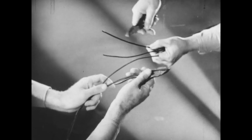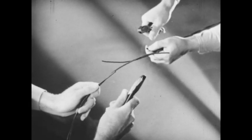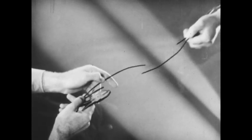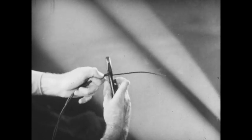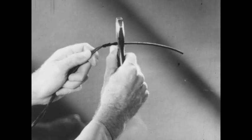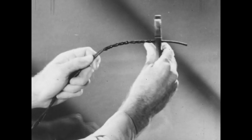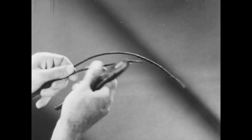For uniformity, each man measures back six inches — or the length of his pliers — on one of the wires and cuts it off. With the heel of his pliers, each soldier crushes the insulation on the long wire starting opposite the end of the short wire. He crushes for about four inches. Next, he measures a pliers length down the short wire and crushes as before.